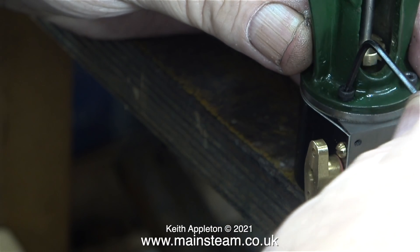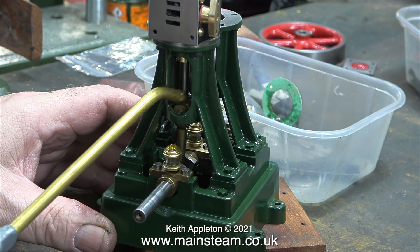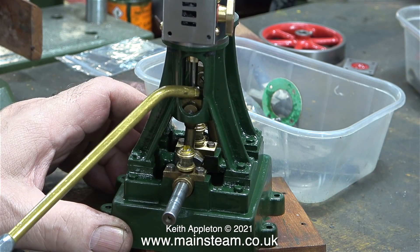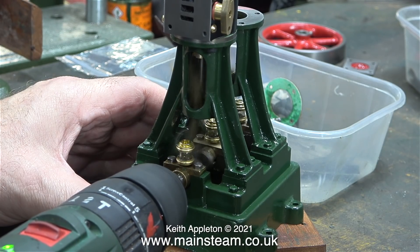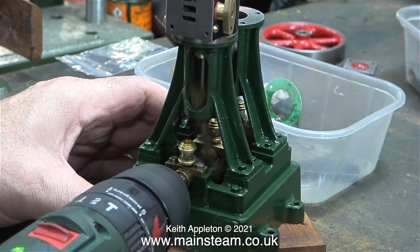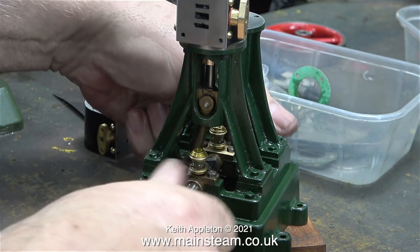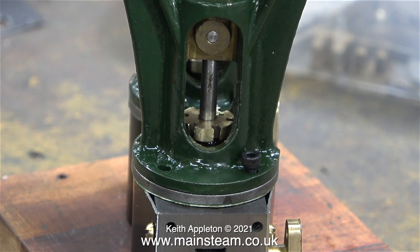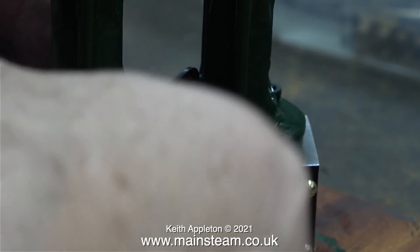The entire job is feeling a lot better than it did previously — the allen bolts are not a tight fit in the holes like they were before. Once I fitted the cylinder and tightened all the bolts, I applied copious amounts of lubricating oil to the moving parts. This is not cylinder steam oil; this is ordinary lubricating oil for steam engines. After connecting my electric drill to the crankshaft and carefully pressing the trigger, I find that the engine is very free indeed, so in no time at all I can run it at a high speed quite safely. This is miles better than it was two videos ago when it was really stiff and lumpy and made a knocking noise. I can even turn the engine just by the crankshaft and it turns over very easily, yet the piston's a great fit in the cylinder thanks to the o-ring. When using o-rings the piston can be slightly smaller than the cylinder — not too small though. Before finishing this piston I removed one thou, so that's two thou overall smaller than the diameter of the cylinder.